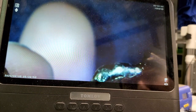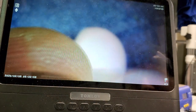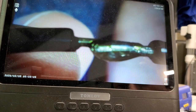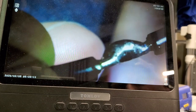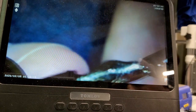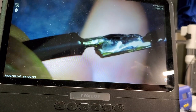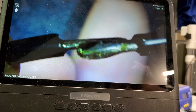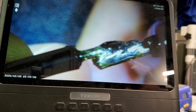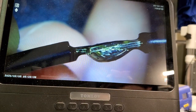For this particular demo I don't think I'm going to have to. Those two wires are bonded pretty well in parallel. There's a bit of extra solder right there, but there are no sharp penetrations that will break through the shrink tube — it's nice and rounded. Preferably I would remove some of that solder, but importantly you don't see any cracks. The solder bled all the way through the wire, and you can see the extra flux — that yellowish color on there. That is two bonded wires.